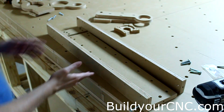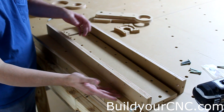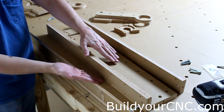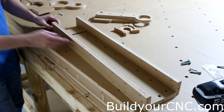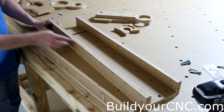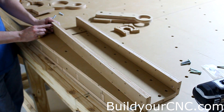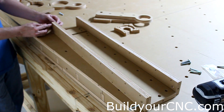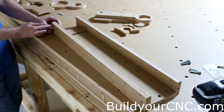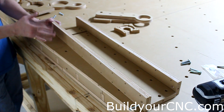The easiest way to assemble it is to put together the assembly without the rails — we pretend the front is going to be over here and lay it down like this. The rail is going to go on this side, which will be the back. We want to make sure that the hole at the very end, which is the end rail support — the last screw for the rail — is all the way on the top side so we have this oriented correctly.